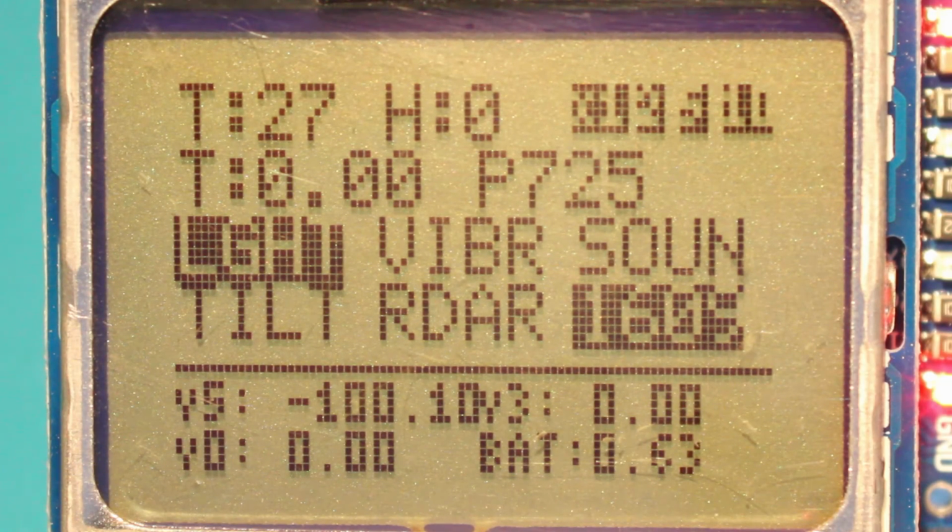And you can do this with any sensors you have. You see that I'm using floats, I'm using integers, I'm using bytes. So I think this covers all the possible outputs of sensors. I'm also using analog inputs, and I'm using different transmission interfaces. I'm using I2C, and then I'm using a struct to send this via radio signal.